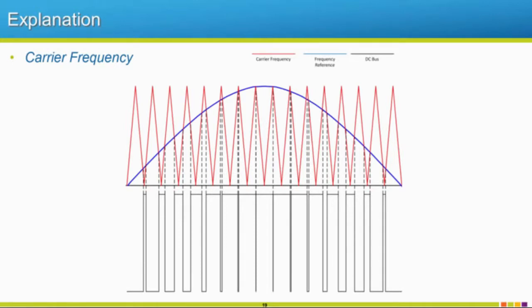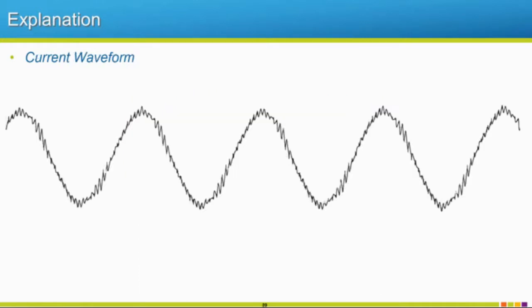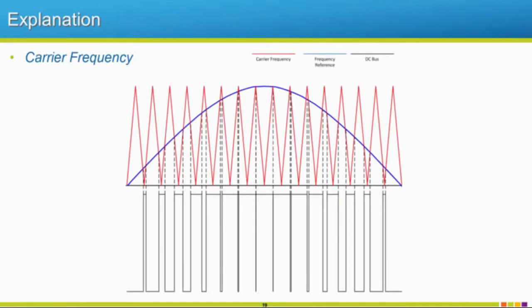The more squished it is, the faster our motor's going to turn. So if you're running some high-speed machine, this could be 400 hertz or more. And maybe you're wanting to run at low speed. As long as your motor's capable of running at this low speed, you could be running with a very wide, stretched out part of your wave.